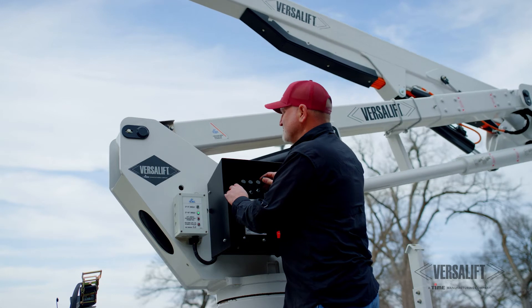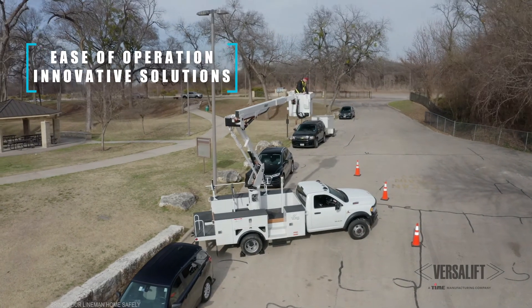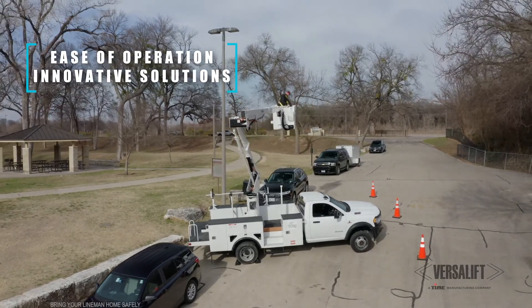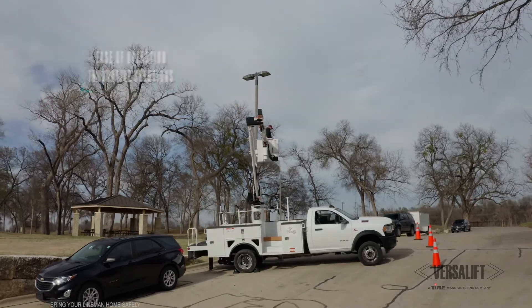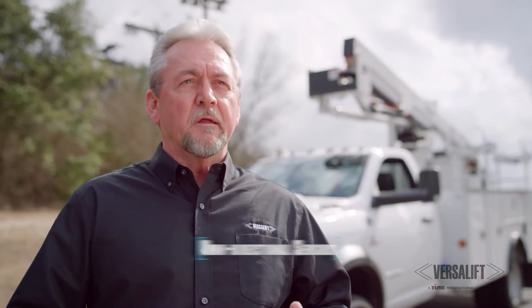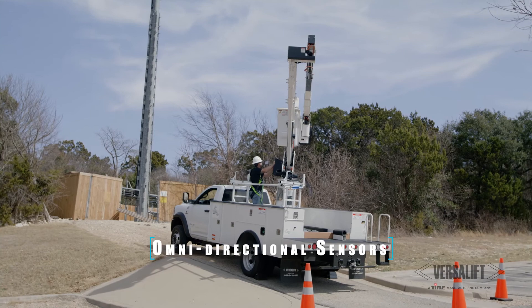One of the unique things about SlopeMax is it comes on when you set the truck up and turn it on to operate the aerial device. There are no extra steps to make that happen. You just turn the master switch on like you normally would, engage a PTO or DC drive, and SlopeMax is on — looking at the angle in every direction that vehicle could possibly be in, to ensure you're not in a position that exceeds what that aerial device can safely operate in.